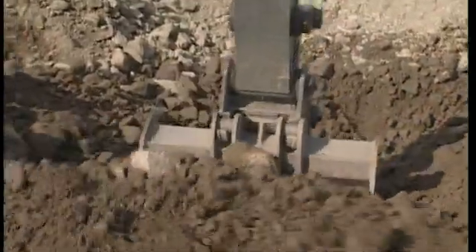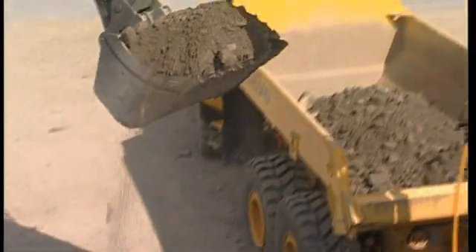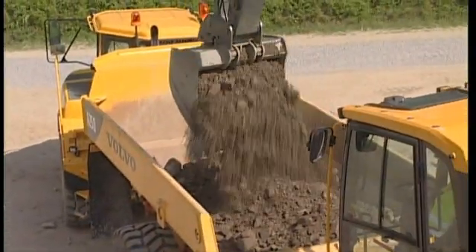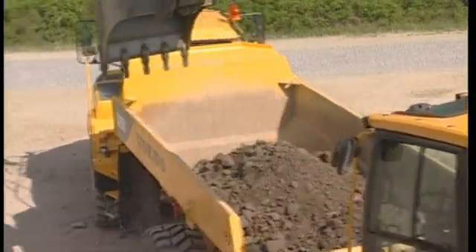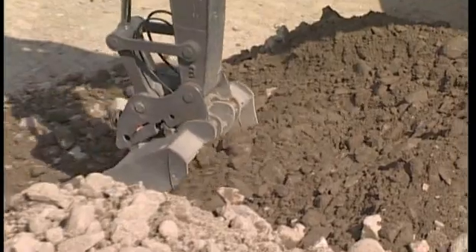For maximum efficiency, fill the bucket with the highest possible fill factor. If too much stress is applied when filling, material could be lost and the level of efficiency will be lower. You would also be consuming fuel unnecessarily. Dump the second bucket so that the material covers the bottom of the body. This will act as a cushioning material for when the third bucket is dumped. The dumping can now proceed at a faster rate.